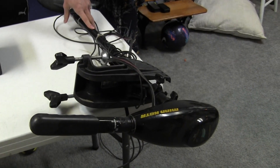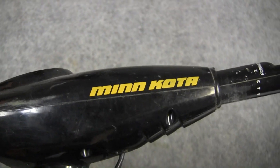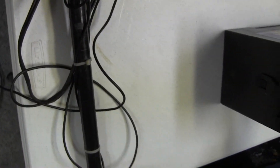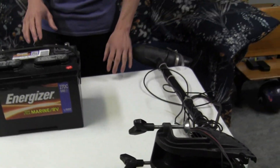Right here I have my 30 pound thrust trolling motor, and I found that on half speed it only takes about 25 amps. So basically this thing I can run continuously for 3 hours, and a lot of times it will run for even 4 hours on a 180 RC minute battery like this one right here. At half speed it moves the boat pretty well — my 14 foot Jon boat — with this battery.